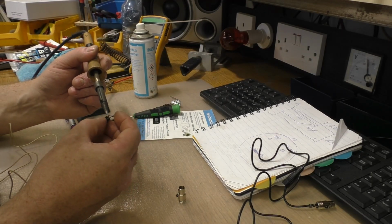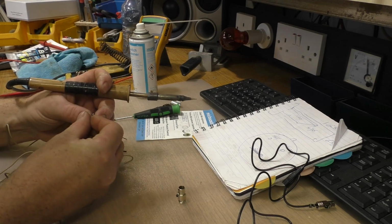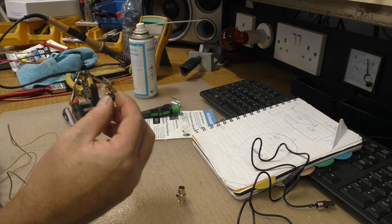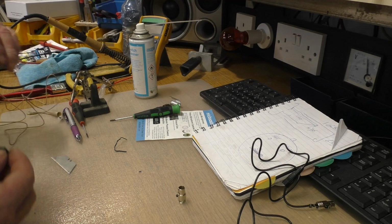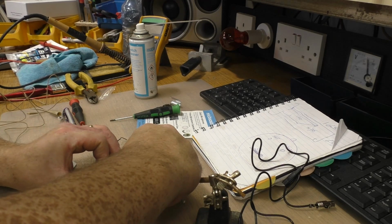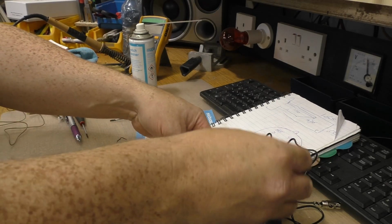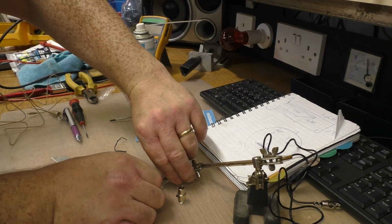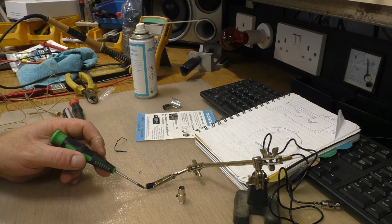Get that resistor off of there. That leaves us with our plug. Okay. That there like that. So we know from what we did earlier with the meter, we know that on the 5-pin wiring, the hot is this one and the ground is this one.